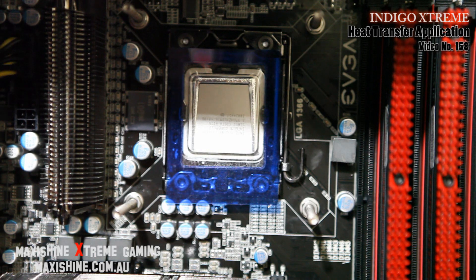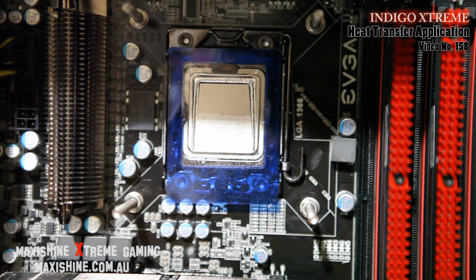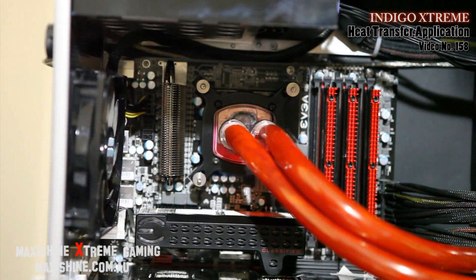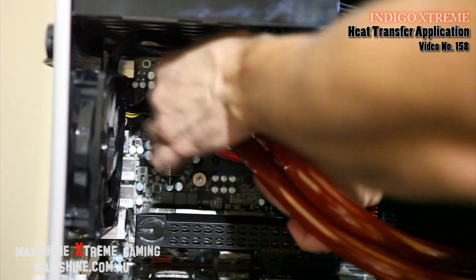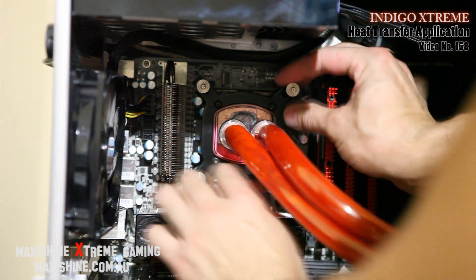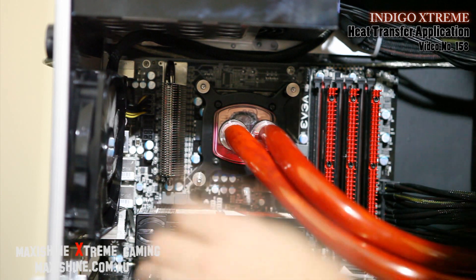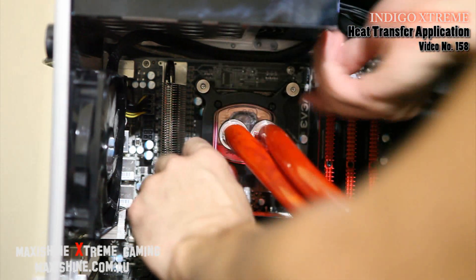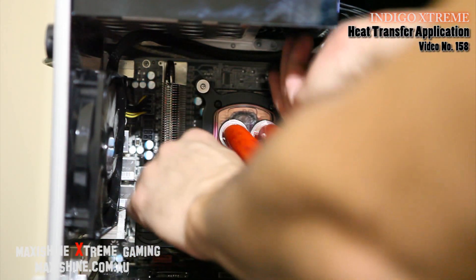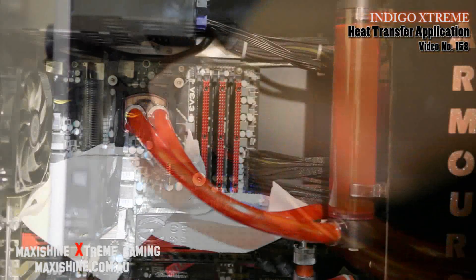As part of installation, the Indigo Xtreme ETI must first be heated with the CPU running under load in order to reflow and melt the phase change metallic alloy, which flows into all the little gaps and imperfections in both the water block and CPU. I couldn't really record this process because I was pretty nervous — they're $12 each and you only get two in a packet, so you want to get it right first shot. I was trying to push the heatsink on straight, holding it with two hands so it touches at the same time, and then putting the screws and springs on. Luckily I didn't have to remove the motherboard because I still had the old EK fittings.